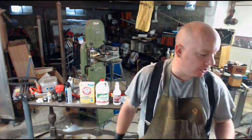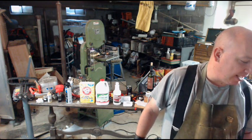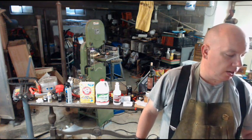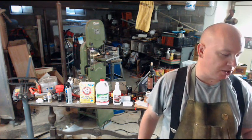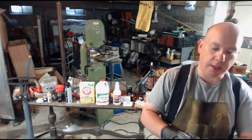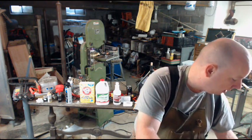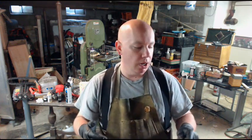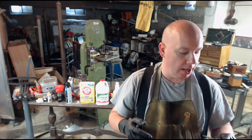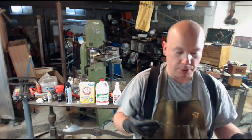Stainless steel is tricky for a tinker or metal worker or artificer like myself because it can be brazed, but the process of brazing it will often run the metal up too hot and permanently scar it or discolor the metal or make it brittle. So we need a process of joining the stainless steel to whatever that doesn't require as much heat. So that brings us to soldering.